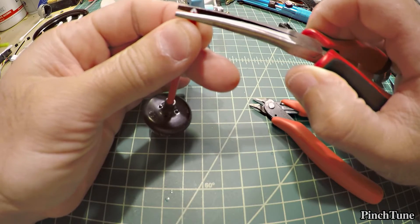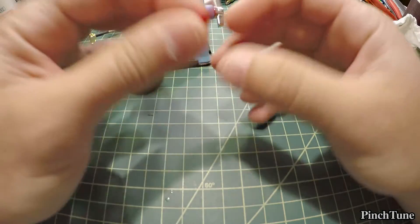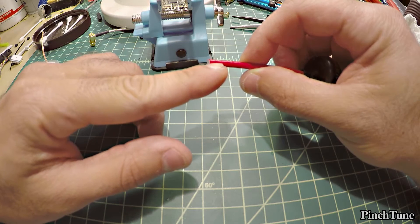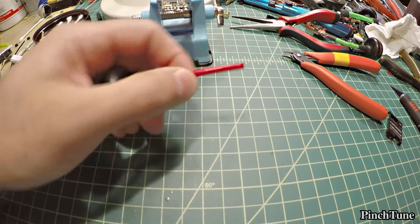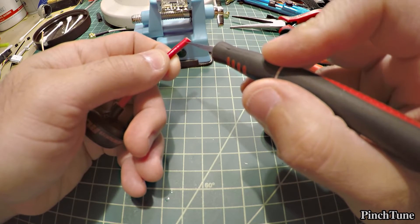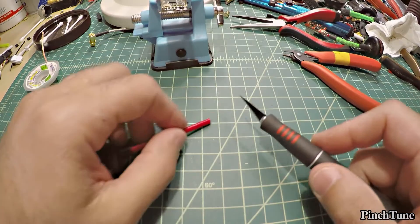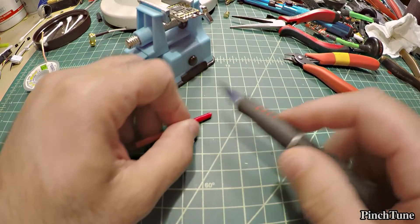I'm going to clean this up a little bit. What we want to do is peel back enough of the insulation so that the pin in the center is exposed, and then peel back enough of the outer insulation to expose the other conductor. That means we're going to have the outer insulation and the pin in the center, so we need to cut two sections — first just cut off enough to expose the center conductor.